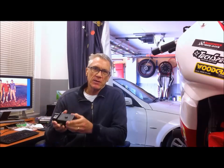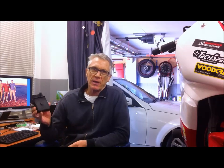Hello again, Scott here. This is the glow plug controller out of my daughter's W164 ML320 CDI. This glow plug controller was used in all the 3-litre V6 diesel turbo engines in the C, the E, the M series, and the G series.